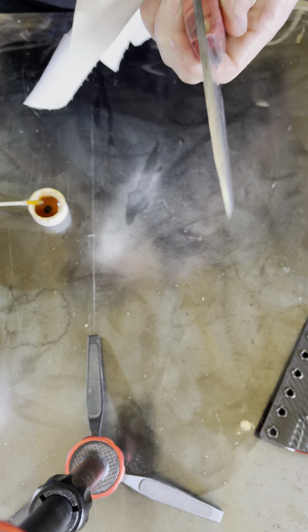Time for this guy. The sharpened edge is already on this one, same as it was the other one. I don't like to put that fine point down on the steel table, so you can see I've got it resting on a piece of scrap Kydex here. And the same as the other one, we just brush the ferric down the tang, down the spine of the knife. Super simple. With this one being as large as it is, it should have plenty of time to darken by the time I get all of it done, and we'll be able to neutralize right away. Now you can see all the black on that Q-tip — that's steel. That's the steel that this ferric chloride is removing.